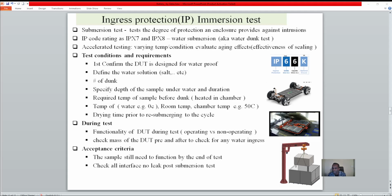So how do we test to make sure those battery packs you can see on the vehicle, which can be 400 or 500 volts with high energy and high power, are protected? Here a sample shows an open pack. You can see all the red gaskets and interfaces, the modules, bus bar, electrical connections, fuses, contactor, and all the safety components. Everything is in here, so when you close it, you make sure you seal it.